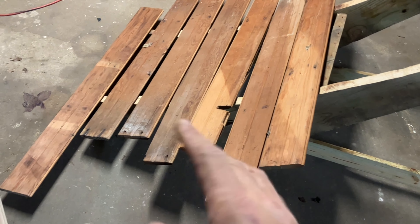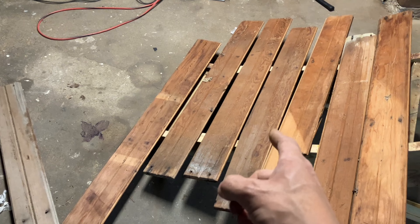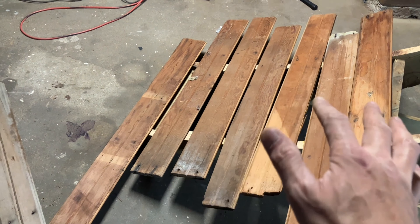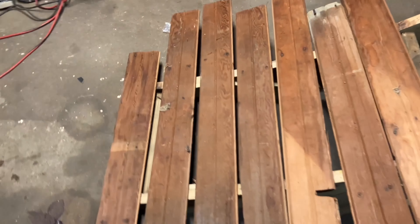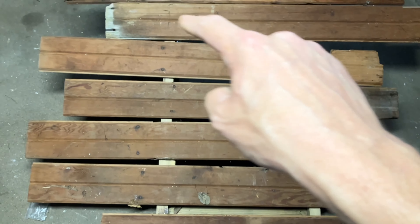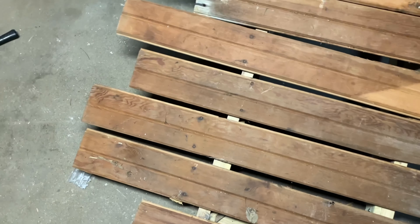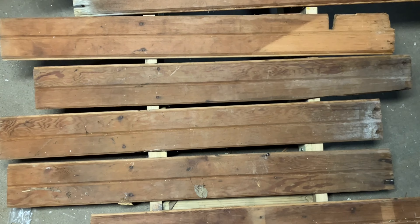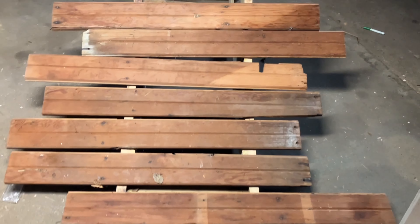I'm in the process of decking the takeoff now, using free boards I've had laying around for a number of years. These actually came from my barn — when I first bought this house there was a little dividing wall in one of my out buildings made out of tongue and groove cedar boards. When we demoed that wall I kept all the boards knowing I'd think of something to do with them. I'm leaving about a one inch gap between them so that if it rains or snow melts, it can drip off and not get trapped between boards.